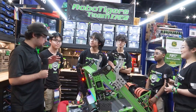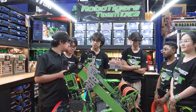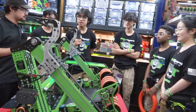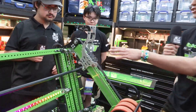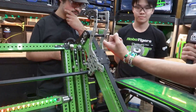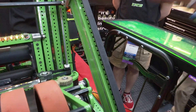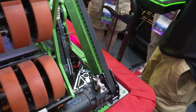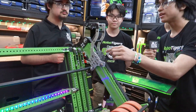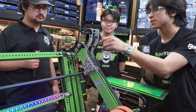Let's hand it off to Hiro to talk about the climb. There are some scratches on the robot, and I also saw a couple of sensors. So let's start with how it's entirely clamped. This belt runs through the entire tube and gets clamped down underneath these plates. Hypothetically, if we were to take off these plates, you would see a plate that has teeth cut out — and those teeth are what's actually clamping the belt onto it. This outer plate is basically just covering it.